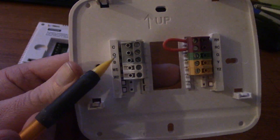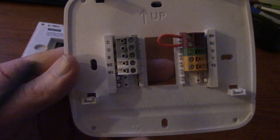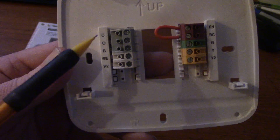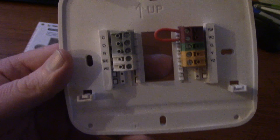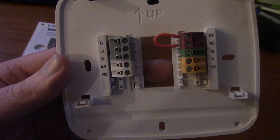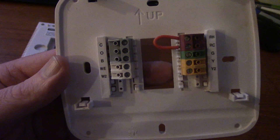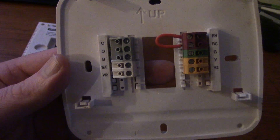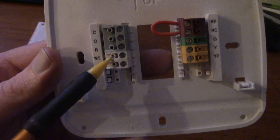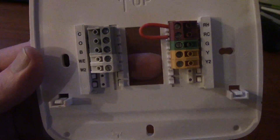Here you have common, O, and B. This particular thermostat is battery operated, or if you hook up a red wire for power and a black wire for common, you will have a 24-volt power supply and it doesn't rely on batteries to operate. O and B is for your reversing valve — it's going to be either an orange wire or blue wire, depending on the system and whether it energizes your heat pump reversing valve for cooling or heating. WE would be for emergency heat with your heat pump, and W2 would be second stage for heating if you have a two-stage furnace.